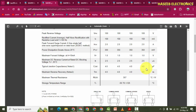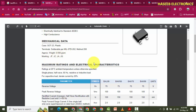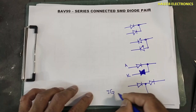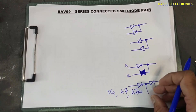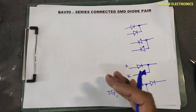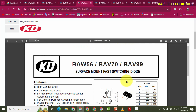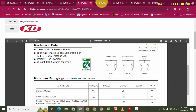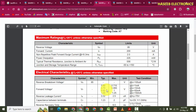Basically it is a fast switching rectifier with a four nanosecond recovery time. Its marking codes include JF, JC, JA, JG, and A7. Different numbers are available from different manufacturers with different package sizes, but it is most commonly rated up to 200 milliamperes. Related types include BAW56, BAV70, and BAV99. The forward voltage is 0.7 volt, with maximum reverse voltage of 85 volt and forward current of 200 milliamperes.